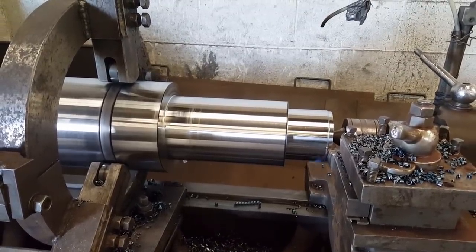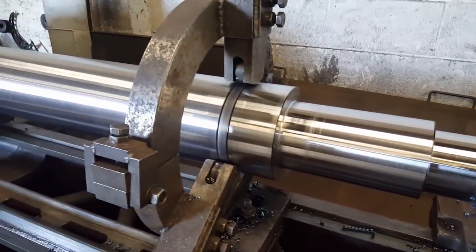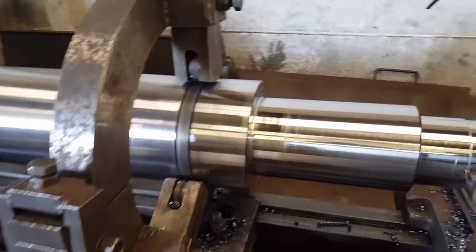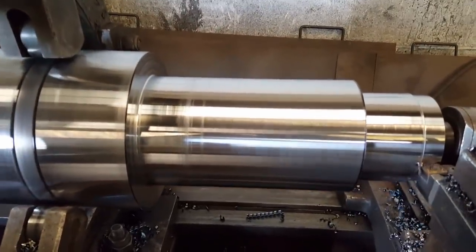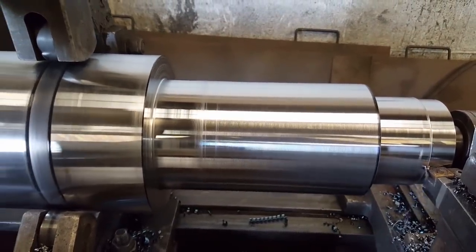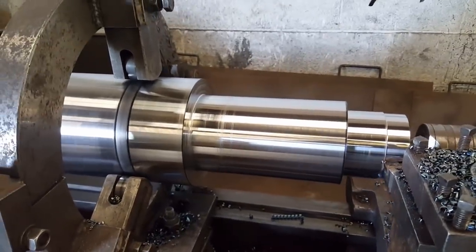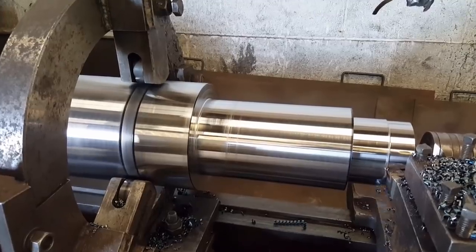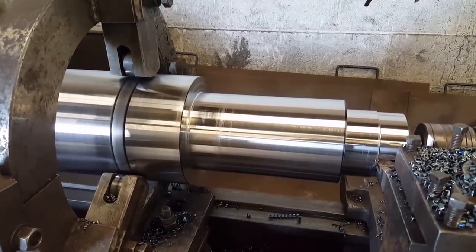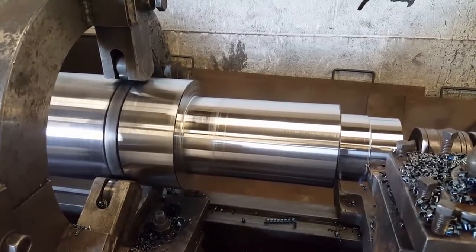Removing the excess length, which was 3.5-inch, which had allowed for any problems they had in the bore if they'd gone too deep. There's one millimetre left on the shank size — I'll drill the hole through it first, before I finish that and let it go cold. If I turn that to size now while it's hot, I guarantee tomorrow morning it will be 4.05, possibly smaller.